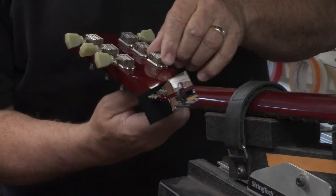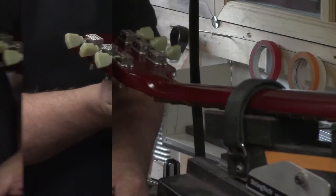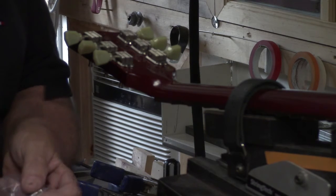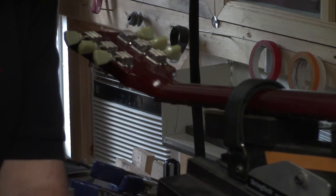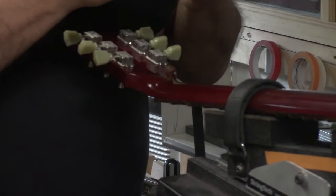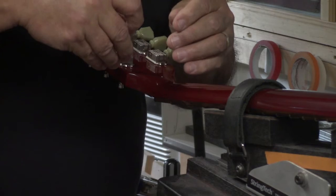She's good to go. Last cuff and washer on. I like to keep a block of paraffin wax handy at the bench and I use it whenever I'm putting screws into wood — just scrape those threads lightly over the paraffin wax and it helps the screws slip into place a little better.